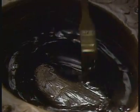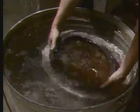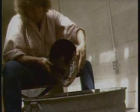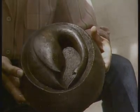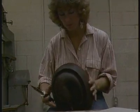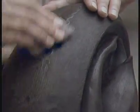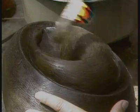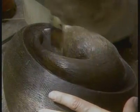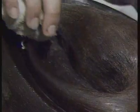The sharper edges of the swan mold need to be brushed more carefully to assure an even thickness. What began as a solid sculpture in foam has become a hollow one in wax. The process is continual change and refinement. What was sculpted in the original is retouched in the wax, adding finer detail.